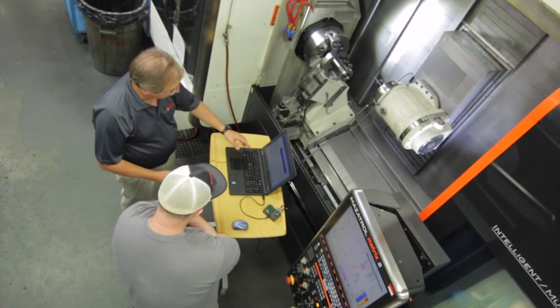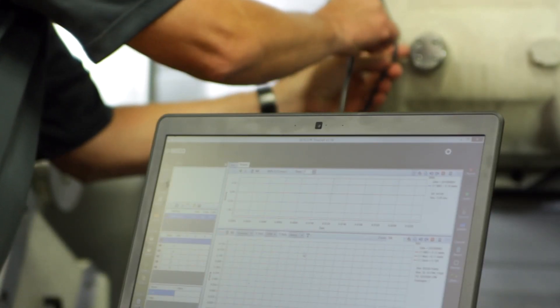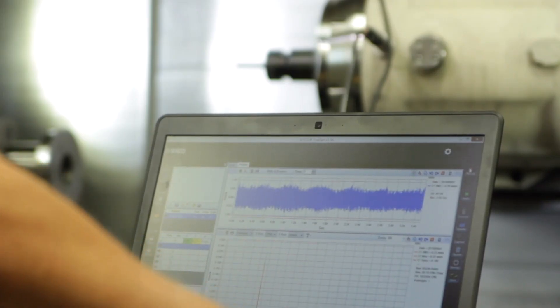The TruSet program can be used for analyzing spindles, but it also can be used for analyzing pumps and motors — anything associated with the machining process around the spindles — so that you can isolate the vibrations, determine what is going to fail, or identify the primary cause of a vibration issue that might be showing up in your manufacturing process.